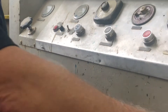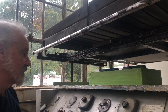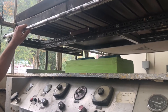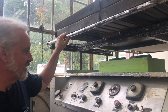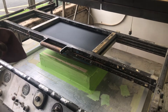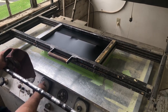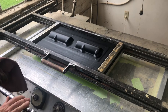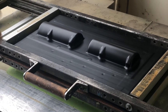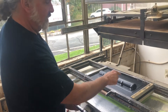This is what we started with. In about another 30 seconds, it's going to be soft enough to go over that form and conform to it — it's called a tool. I'm going to push the oven back so that you can see it better, and lower the frame slowly. Normally that would all happen more quickly and simultaneously: the oven would go back, the frame would go down, the vacuum would kick, and you'd get a tighter shot.